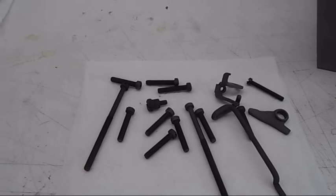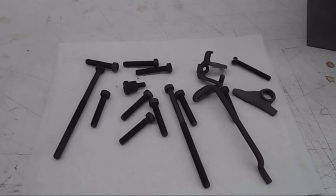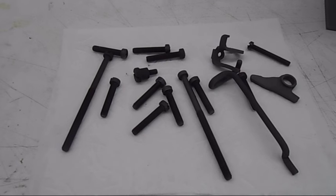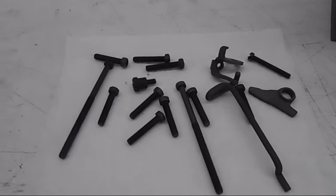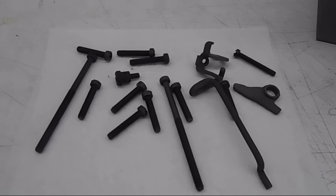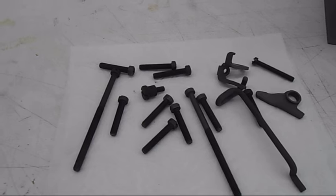All your steel fasteners and sheet metal parts on cars that weren't painted either had a manganese phosphate or a zinc phosphate, which is a lighter gray color. They all had some type of coating — they weren't going to ship parts to the manufacturer on the assembly line without some kind of protective coating on them, because they'd rust.